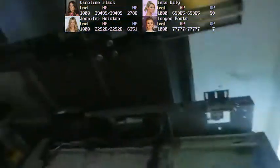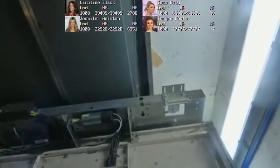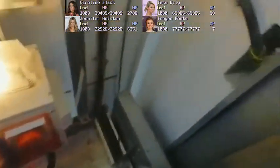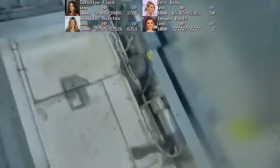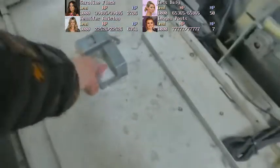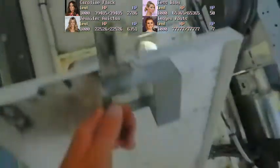Let's take a look at the motor. Looking over here, here is the rescue flap. Let's open it up. Notice the switch thing you have to move to open it — this actually breaks the safety circuit so that the lift can't move while the flap's open. And if you open up this flap, can we see into the lift? We can't — the lighting is in the way. What idiot designed this.